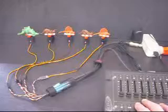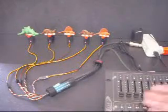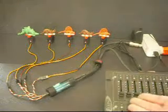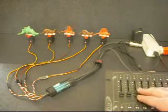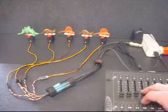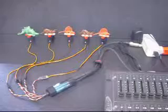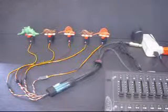The Servo Pack 5 requires five channels — one for each of its servos. The Servo Pack 5 is shipped from the factory with its DMX base address set to 1, so the first servo is on channel 1, the second on channel 2, third on channel 3, and so on through channel 5. However, this may need to be changed if you have other lights, fixtures, or servo packs already occupying DMX addresses 1 through 5.